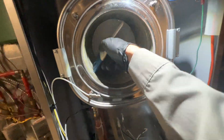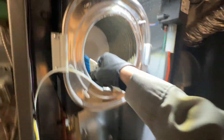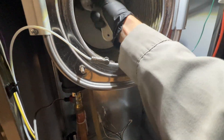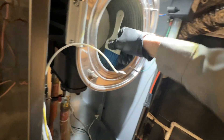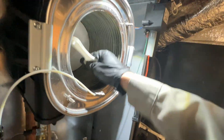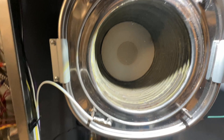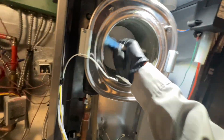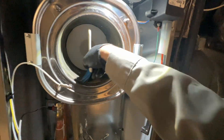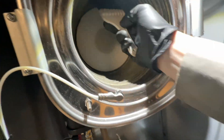You can see all the dust that's coming out of here — I think the camera's picking it up. I can actually feel that it is going pretty deep in there, so I don't think they're going to be very clogged, but I'll be shoving a card in through it just in case. You do have to be careful near this rear refractory — I forget what they call it; they don't call it that but that's what Burnham calls it. Because if you start scratching that up it just disintegrates, and you're not supposed to get it wet either, because the same thing happens where it totally disintegrates.